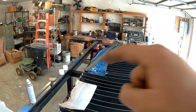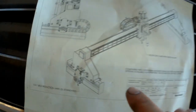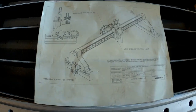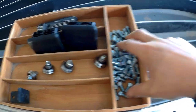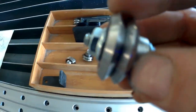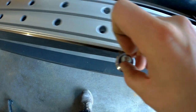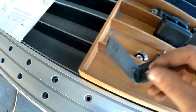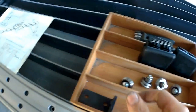We look a lot more like this picture right now. The only thing we're missing is the V-rail. And from there we can work on mounting up those rack gears. And once we're done with that, we will get to messing with these gear reduction units and mounting them up here on the gantry. The kit came with all the hardware we need to bolt up the V-rail. This is the actual bearing that sits on that V-rail — you can see the nice V-shape right there, which gives it the name. And this little bracket, I haven't figured out what it's for yet, but it looks important, so I'm going to hang on to it.